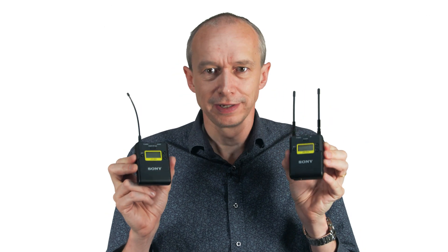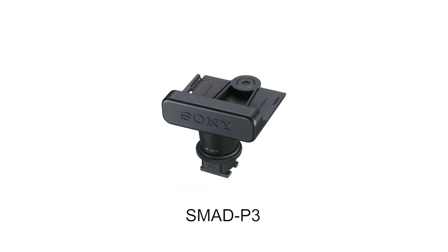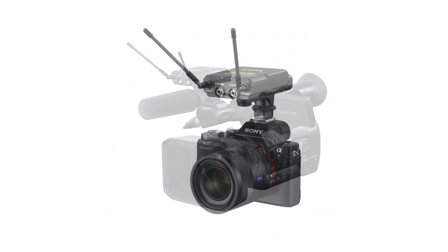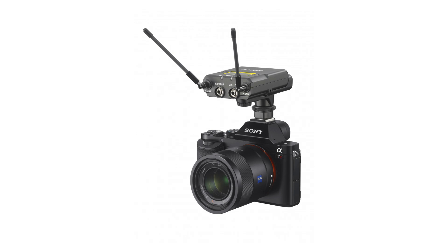These have some really neat features, and that was one of the reasons for wanting to get these. If we look at the receiver on the bottom, there is a docking port and a USB port. Using these, you can charge the radio mic — you can put rechargeable batteries in it and charge from an ordinary USB charger, say a cell phone charger. You can also power the radio mic from the USB, so if your camera has a USB socket, you can use that to power this radio microphone. If your camera has one of Sony's MI shoes, there's a docking station for some cameras that docks directly into it — no cables needed. The audio is passed via that shoe to the camera, and the microphone is powered by the camera. That's a really neat feature.